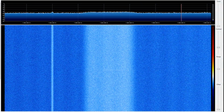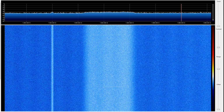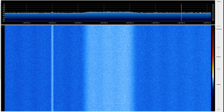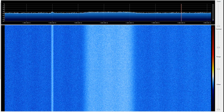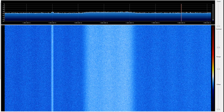Primarily, radio and weather reception hobbyists have been using these grid dish style antennas for listening in to the GOES 16 and GOES 17 HRIT signals broadcast at about 1.694 gigahertz. These signals contain full disk images of the Earth, among other bits of information, which have been incredibly valuable.